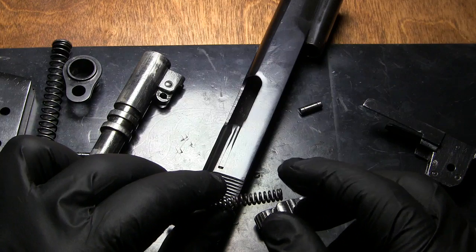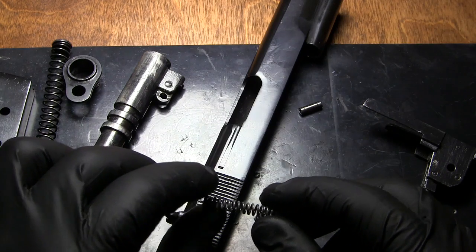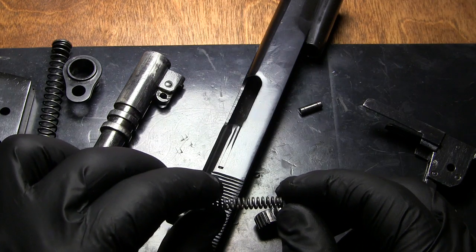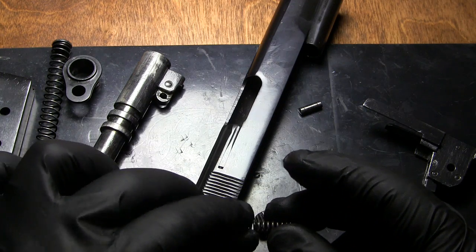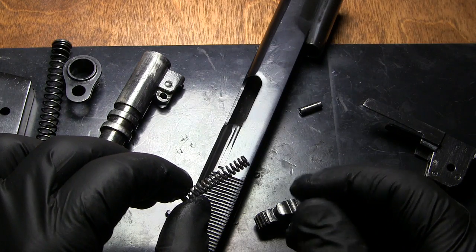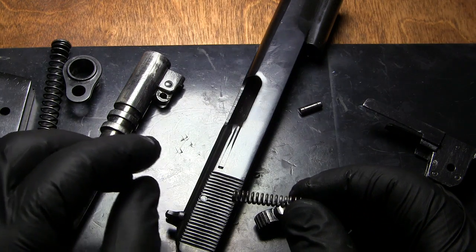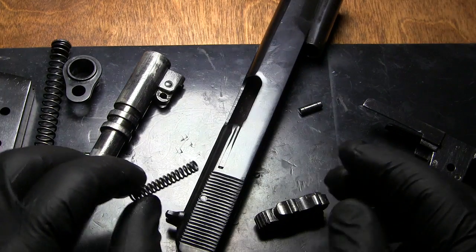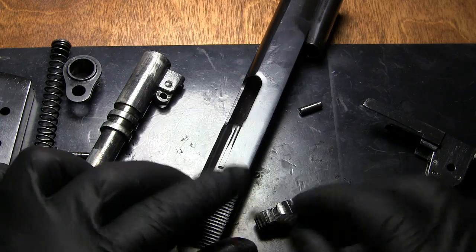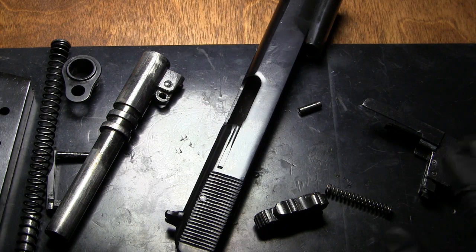It wasn't a light striking hammer, but it was much easier to cock the hammer when the spring was a little bit shorter. So I don't necessarily say you should do this, but I have done this, and it did improve how easy it was to cock the hammer and rack the slide on the pistol. Although just polishing the surfaces that I just mentioned without shortening the spring took care of the smoothness of the action. So I would highly recommend that everyone with a Tokarev pistol would do the same.